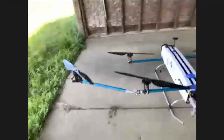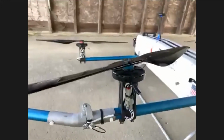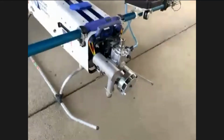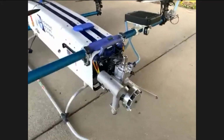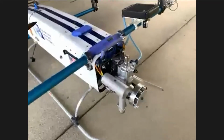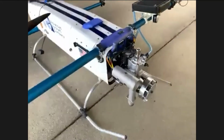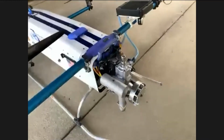Hey, Kat. Yeah, so here's one prop, and you can see it's just an electric motor. There are no drive shafts in here. The crankshaft of the engine only spins this starter generator. So there's no drive shaft, which makes it a lot simpler from a maintenance complexity perspective. All these components are modularized LRUs. The most time-consuming LRU to swap is the engine generator unit, and we've demonstrated to our customers that they can do a complete engine change in less than 20 minutes, which is pretty rapid.